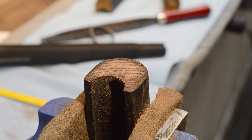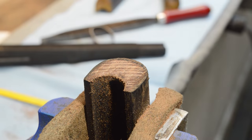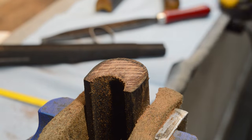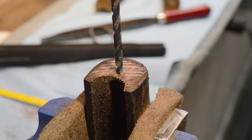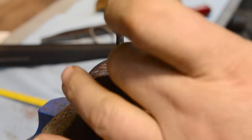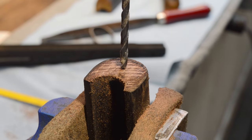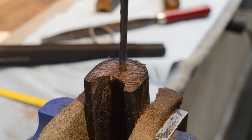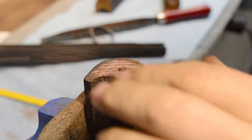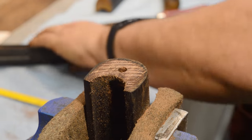We'll grab a drill motor. And we'll drill a pilot hole here. So the question becomes, where do you put this reinforcement? Do you put it up high so that when you try to bend the stock this way, that rod's under tension? Do you put it down low, let the barrel reinforce the top, and this reinforces going up? I'm gonna split the difference, drill right in the middle, because we don't have any cleaning rod here. Now we broke out into the lightning channel down here. That's fine. That's what we need.